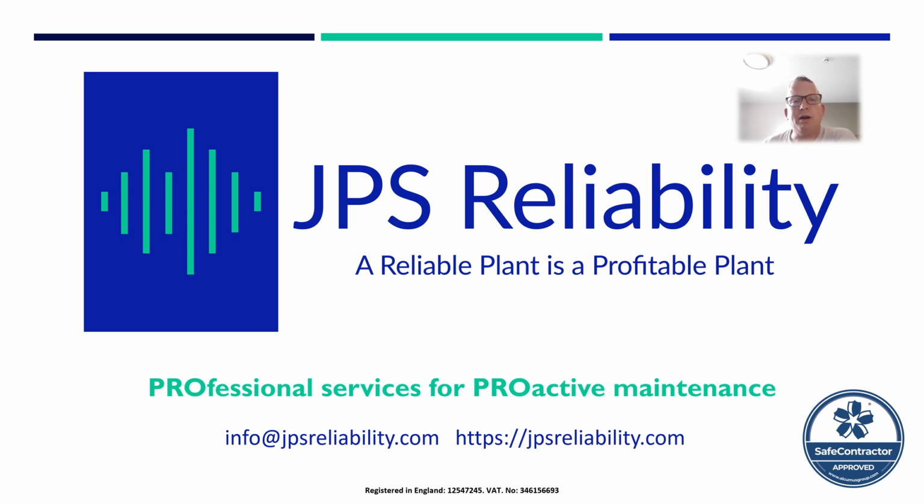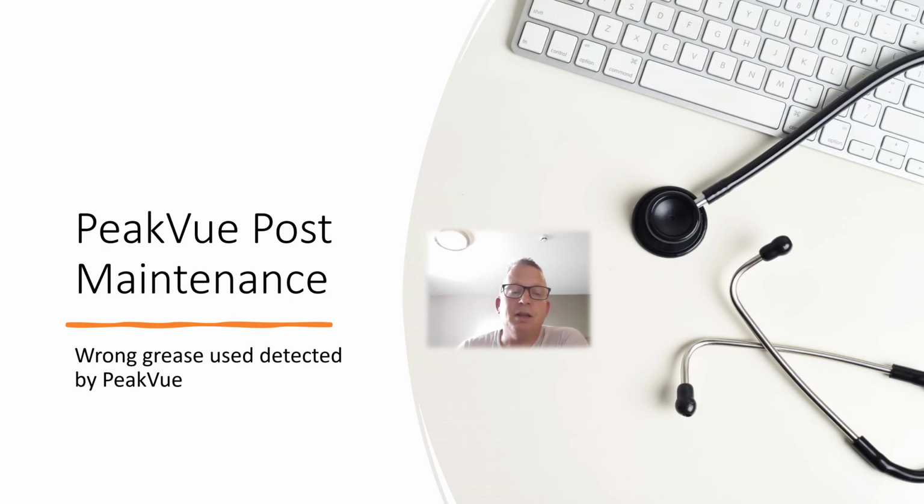RMS have been a vendor, supplier and user of Emerson equipment for many years now, from the 2115 to the new 2140, the online system 6500, and also the new wireless system. Now, this presentation is more of an educational one about PeakVue and how you can use PeakVue technology to resolve or find any lubrication issues before you get any defects with your rotating assets. This one is on post-maintenance, where we did a survey at a plant and detected the fitters and mechanics had installed the incorrect grease.